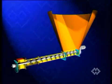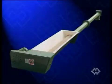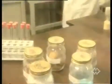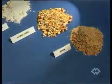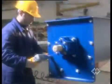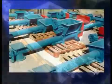According to the cross-section of the silo outlet, SU-type single-shaft screw feeders are available with standard U-shaped or with flare trough. In a light-duty version, SU feeders are used for flour materials with similar bulk density and properties. For animal feed and similar products, a heavy-duty version is available. In the DO version, the feeder is equipped with an additional inlet hopper, including an agitator tool.